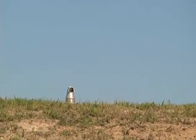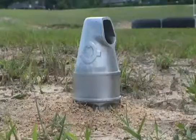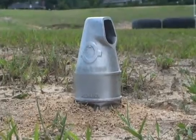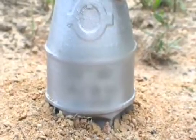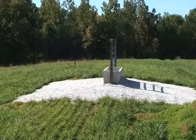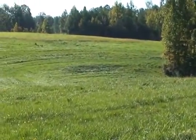You may also need to install air relief valves. They prevent air locking, which can interfere with water flow. Sometimes an air-filled pipe can even collapse. If the pipeline runs uphill from the water source to the tank, an air relief valve should be installed at the line's high point at the crest of the hill. But you can eliminate the need for air relief valves if the water trough is located on the top of a hill so that the line runs only uphill and the air can escape through the trough itself.